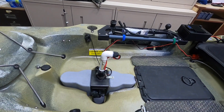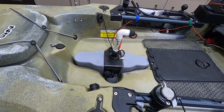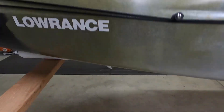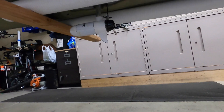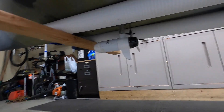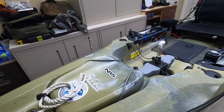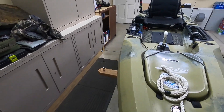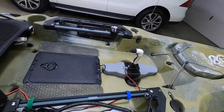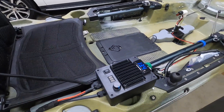You can see the head has been removed, and I put it through the cassette — actually a cassette for the PA-14, but it worked just fine. There's the trolling motor, and it's a 24-pound thrust. It works great; I'll get up to three and a half miles per hour. I'm not a small guy — about 240 pounds — so it gets me out there just fine. And the thing I really like about it is the speed controller that I put together.